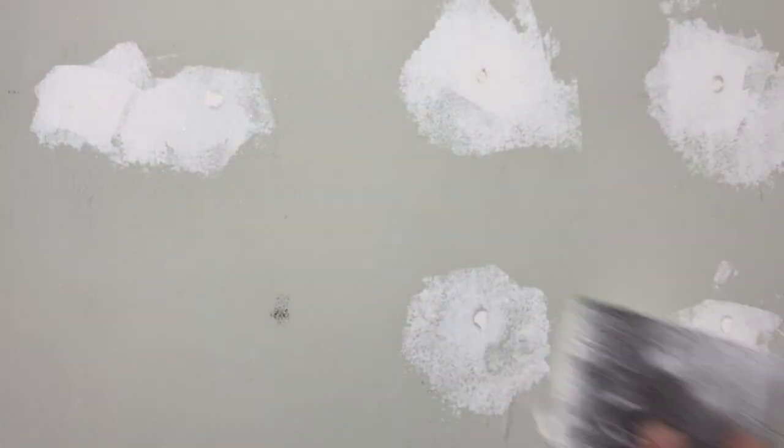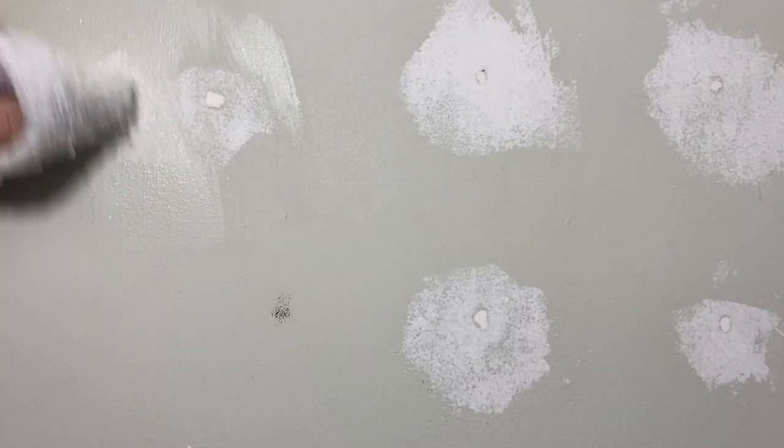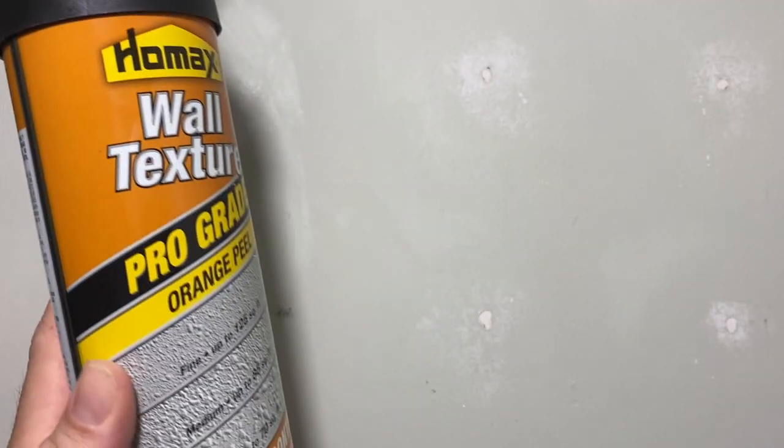Now we're going to give it a light sanding to make sure it's completely flush with the drywall and there's no excess spackle hanging around. I'll take a wet rag and do the same thing again, but being much more careful this time — I'm not going to try to take all of it off because it's not a big deal and the texture will cover it. But if you get the wet rag into the holes it can pull out the spackle, so be careful. Pro tip: sometimes the texture can glob or make imperfections before you spray it, so I spray it on paper first before putting it on the wall. Now that it's dried it looks really, really good. That texture is very thin — if you ran your hand over it you'd barely feel it — and once we paint it, it will look great. You can barely even tell where the holes are.